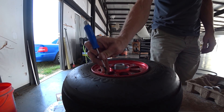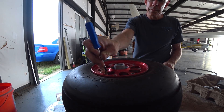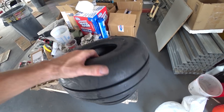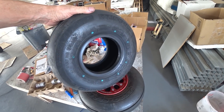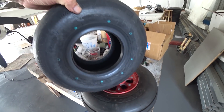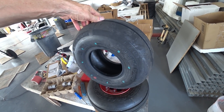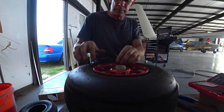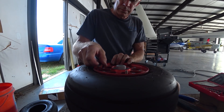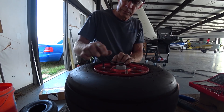Here I'm letting the air out of the old tire. It was actually a good tire — it came from Beringer — but speaking with some knowledgeable people they recommended putting a Michelin on there, which is a much more stout tire rated a little higher. This rim works as a tubeless setup: you just undo all the Allen bolts after taking all the pressure out, and the rim just comes apart.